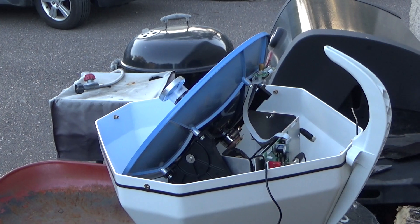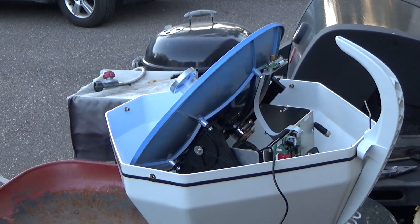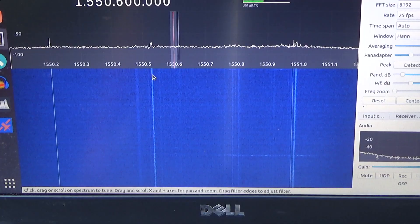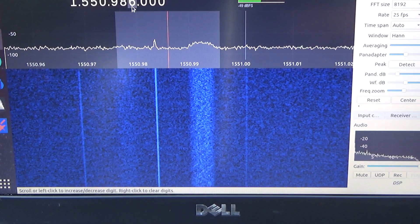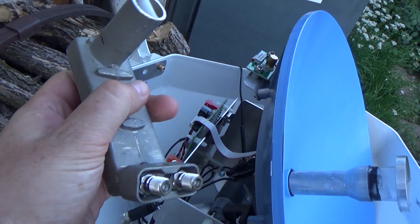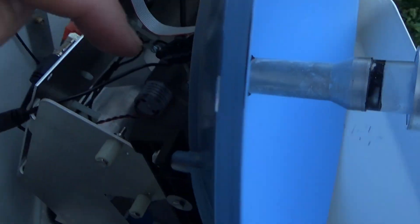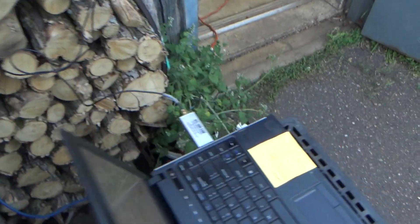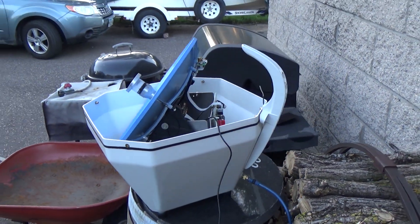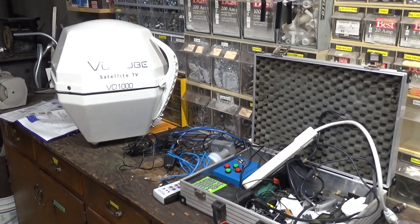That little L-band patch is supposed to be just a stand-alone wide beam receiver, but I've actually got it stuck to the back of my dish, and I'm aiming my dish around at the geosynchronous Clark Belt of satellites, just seeing what I can pick up. We're definitely seeing some stuff on L-band — here's a random satellite, not sure what this one is; here's another satellite data stream of some sort. When using the little L-band antenna, I'm not using the original LNB at all — I've just got that L-band patch jammed in there, getting signals reflected off the dish. I'm still powering the dish with my power injector, but that's just driving the motors on the pan and tilt system.